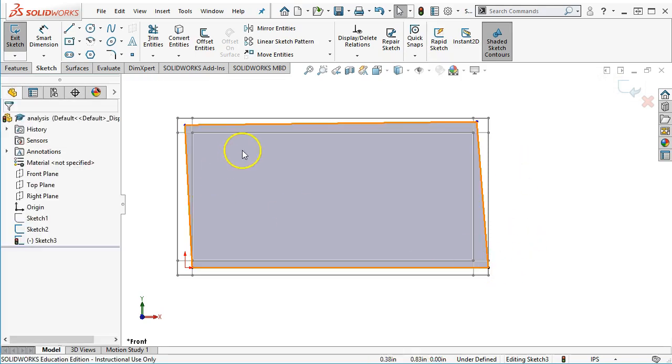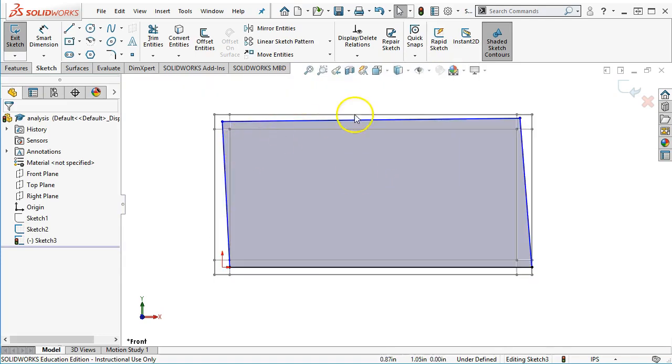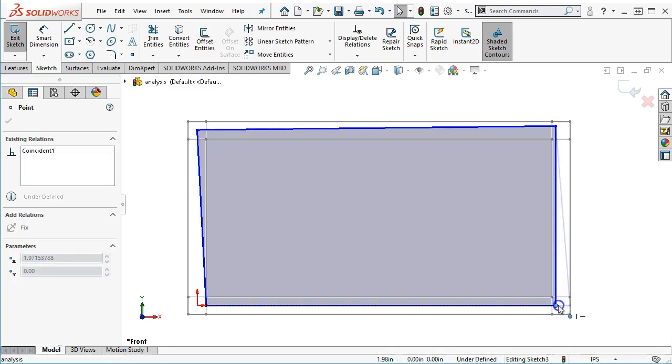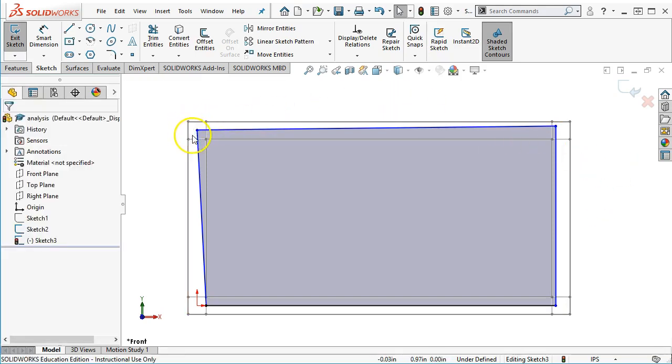All right, so one of the things I want to do with circularity then is play a little more with the ellipse, and we'll do that. I think I'll add a pin. So be aware that I'm probably going to move away from the shoulder bolt as the connection, and we'll make a pin that goes through that will just have a washer or a button head or a cap screw on the back side of it that's able to contain the pin into the bearing. All right, so I'm going to post this for the part file up onto Canvas.